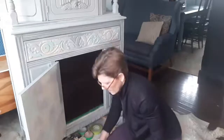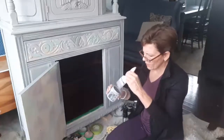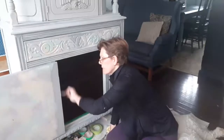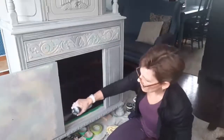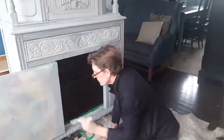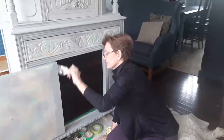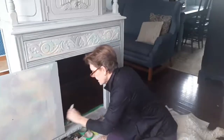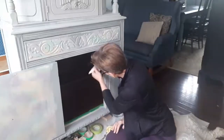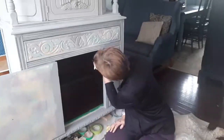When I started this cabinet and began the wash, this container was full. I'm now down to a little less than the last quarter, just to give you an idea of the volume of wash you might need. I'm using my spray bottle a little more here, only because I'm trying to extend how far this wash is going to go — to see if I can make it last through the whole piece, keeping in mind I still have the top to do. If I have to mix up a little more for that I will, but if I don't have to, that's a bonus.